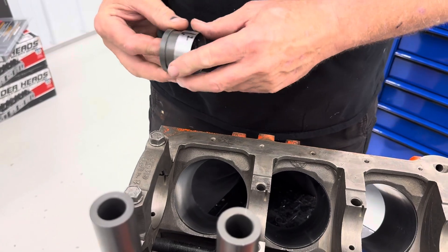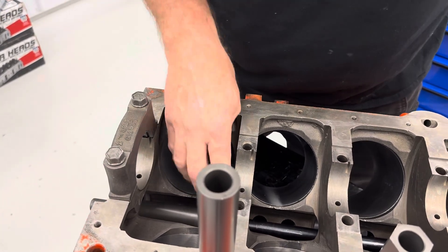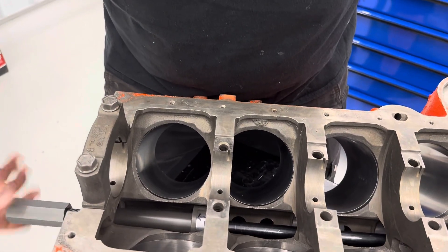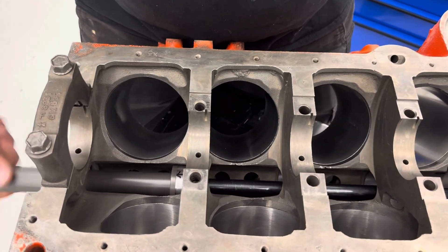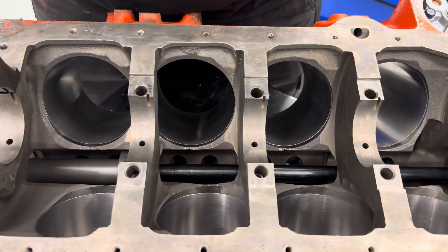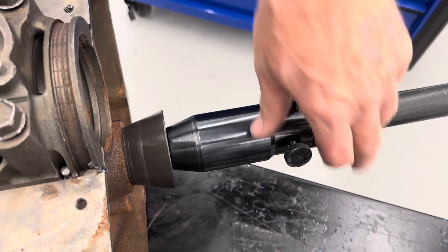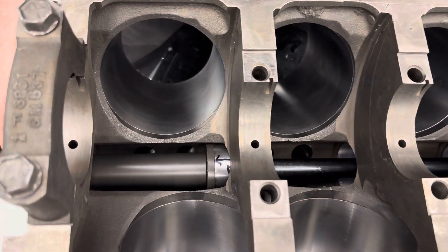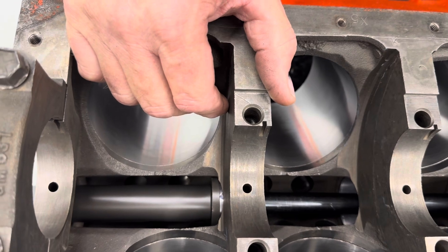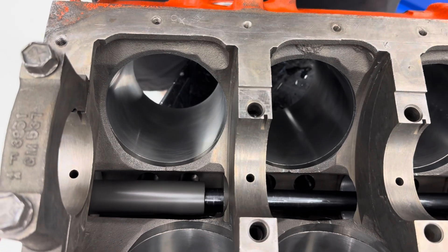Go in with the two, through the front. Put on the nut. What you've got to remember to do each time is to release the pressure from the hydraulic unit, so you get back to the full travel. Always back off the pressure, put it on, and here we go with our number two.